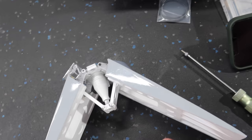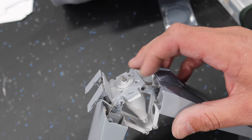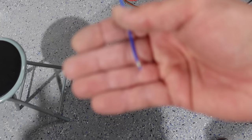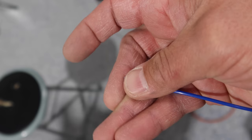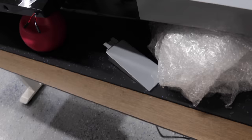We're going to Loctite all four of our primary fasteners first. We're going to put a couple drops of silicone oil on each side of the cylinder. The air fittings are actually a really nice setup — to get them off, you just grab the little metal bit with pliers and pull them off. They work really well — you can just snip off a little bit of air line and install the new air line. Running the little metal piece up over the fitting is actually pretty cool. Both our air brakes are now serviced, dealt with, sitting beside the plane ready to be reinstalled.